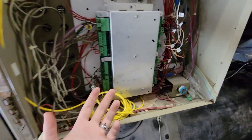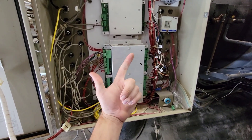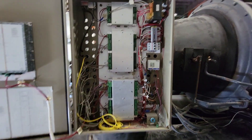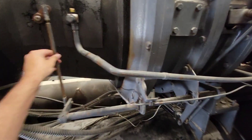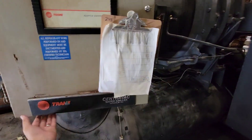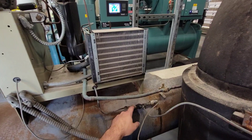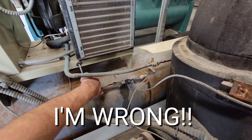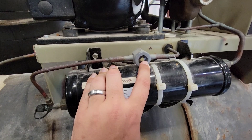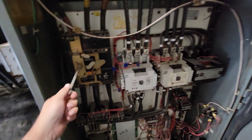I haven't completely gone through this one yet. Under quarterly inspection it's mostly visuals - we do annuals, semi-annuals, and then two quarterlies every year. The quarterlies are more visual-based than anything: checking in that all electrical is okay, all mechanical components are okay, readings look okay. We're not trying to put the equipment under major load - just letting it operate at whatever load it's already under naturally. I did find that this valve was closed, which is part of our drain valve coming off the purge assembly. My moisture indicator does show a little bit of a color turn - it's not a true green like I'd like to see.